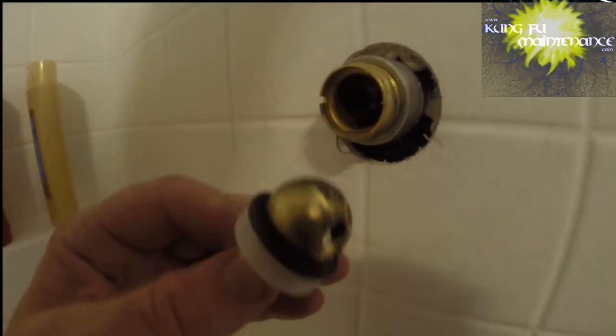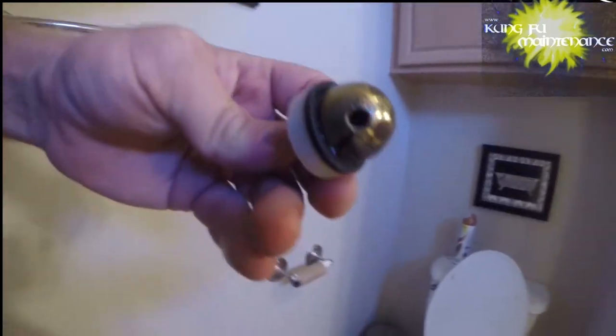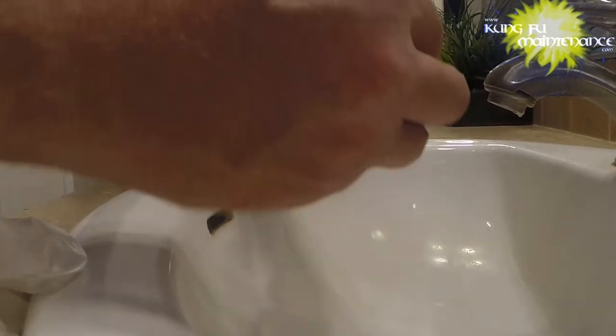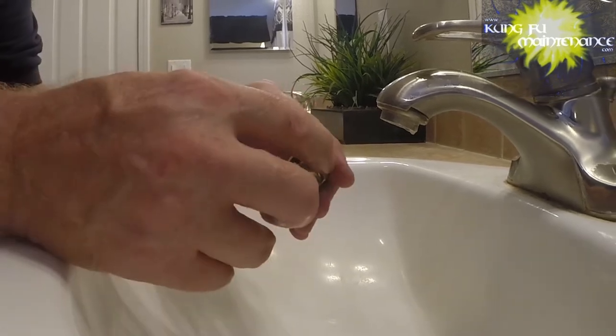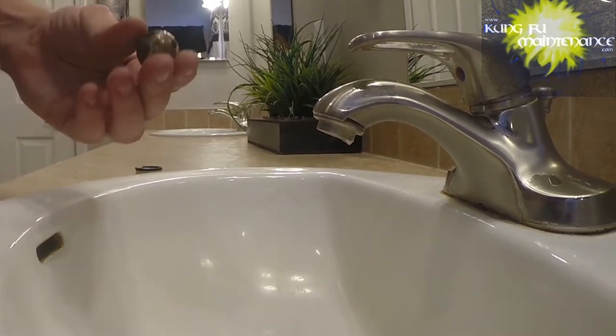You can get rebuild kits for these. I'm going to try to clean this one up. It's got a slot on one side here where the ball goes in. I'll take this and clean it out. It's just got an O-ring seal — you may even be able to flip that O-ring seal over. Here's the seat and it's got calcium buildup here. We're cleaning all this off.